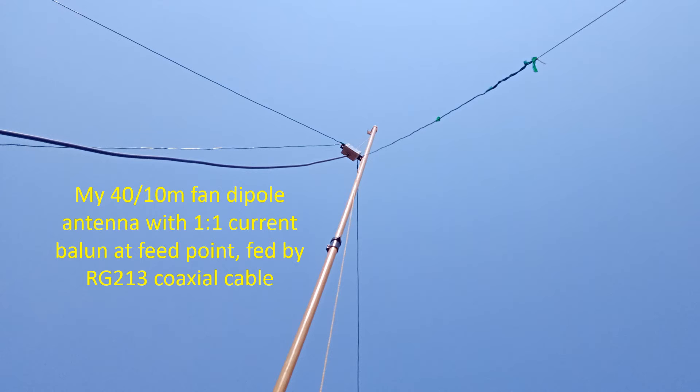there is no point in using a ladder line if you are operating on 40m, 15m, and 10m with an inverted-V fan dipole for 40-10m. I am using RG213 coax with 50 ohms impedance and a 1:1 current balun at the feed point. As he mentioned, the balun strips off currents on the outside of the shield and avoids the problems of a radiating hot feed line which could occur if the balun was not there.